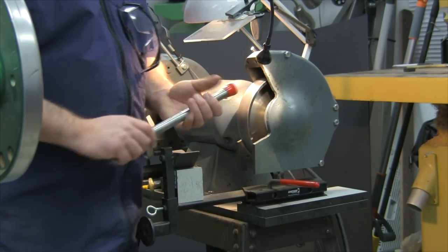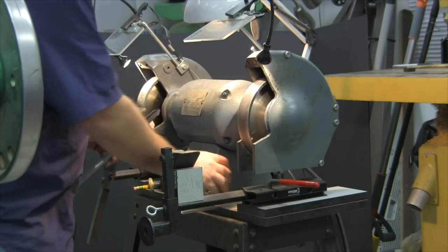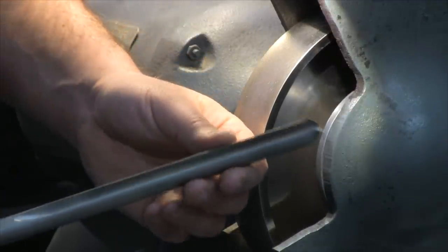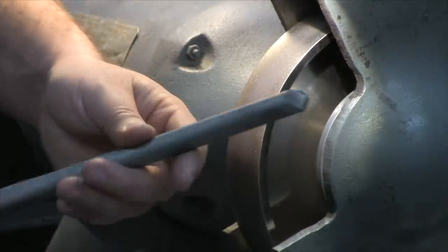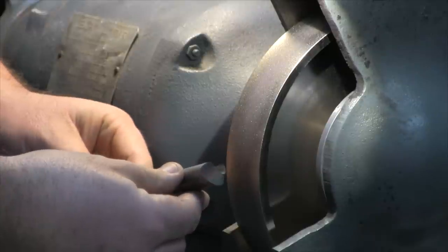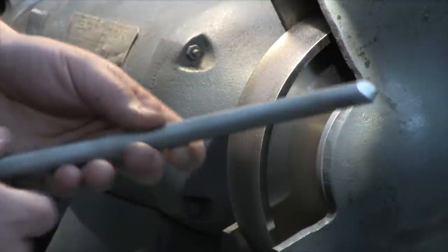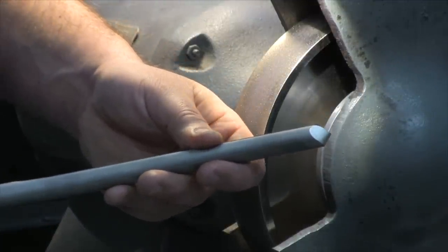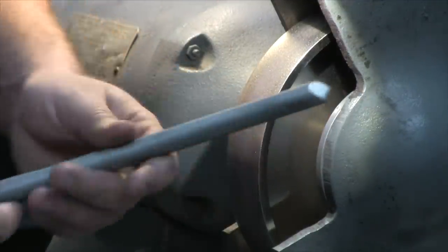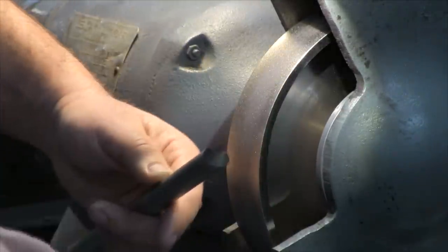Let's take a look at it. As I said, 5/8 inch diameter steel, V-shaped flute. Now, in my opinion one of the reasons why that tool may have split on me is that the cross section of the gouge, while it was a V-shape, was just a little too thin.